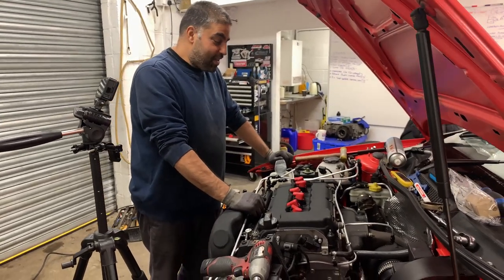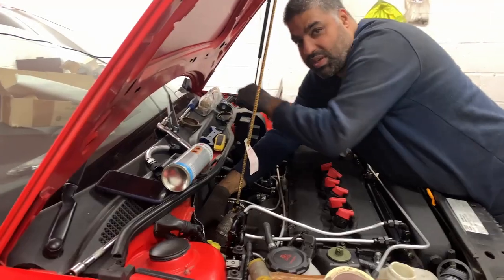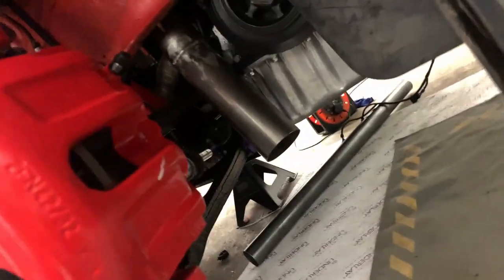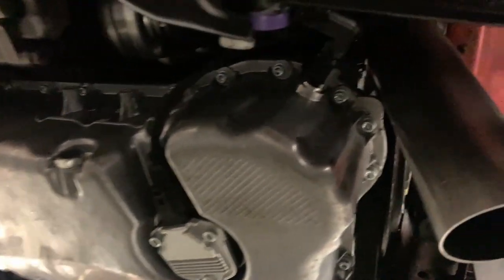Intercooler pipe work - once that's done we'll be ready. Vass is currently just bolting the downpipe back together and this is a tough car to work on; clearances are really tight. So anyone out there wanting to build an R32 turbo, just take into account all of the clearances that go into everything. Let me show you where the turbo pipe is running. This pipe that we've started to build comes out at an angle to keep it away from the engine, then does a 90 at the top and goes straight into the turbo because it is an aftermarket turbo.